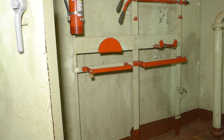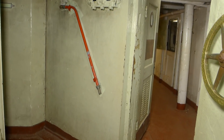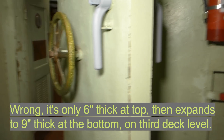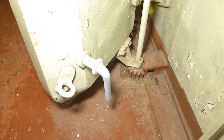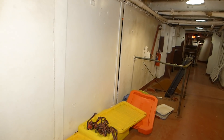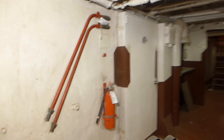I'm now standing in a passage on the starboard side in officer's country, immediately ahead of the armored citadel. We have this diagonal armor that's quite thick — about 9 inches. To provide maximum protection, there is also an exceptionally heavy armored door here that can be closed, but due to its weight it had to be operated using a geared mechanism with a wheel on each side. Once inside, outboard are the gun casemates with upper and lower casemate armor; this bulkhead is the STS armor acting as a splinter shield.